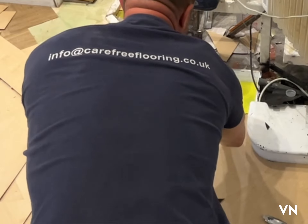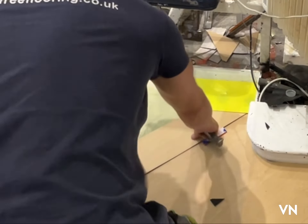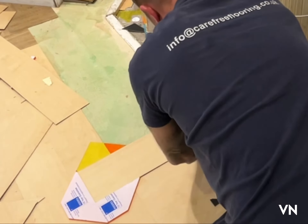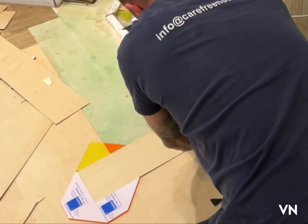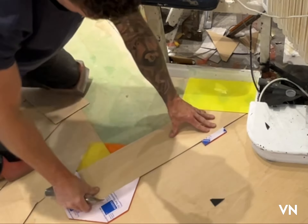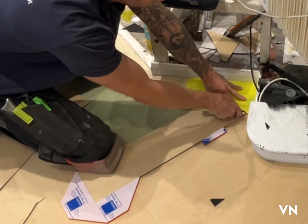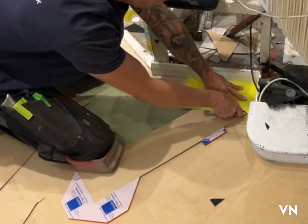Up against that wall — push it down. Left hand into the board so you know it's on there, then just get that cutting out. You can come the other way if you want — you don't have to do it that way. You can turn around and do it that way. It's in position — it's not tile on tile slipping anywhere, it's there in position. That way it just can't go in wrong.